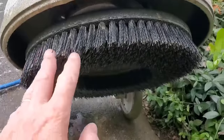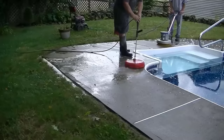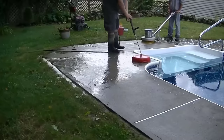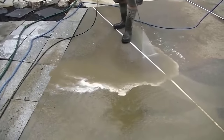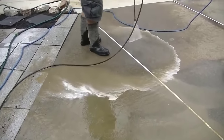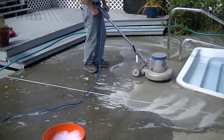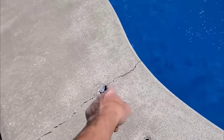This pool deck was in really really bad shape as far as being dirty, so we actually had to use a scrub brush with it. But that's the basic prep right there — pressure washing it, getting rid of all the dirt, the mold and the mildew, getting it clean, and then letting it dry out. Then you can put two coats of this paint on and your deck is going to look just like brand new again.